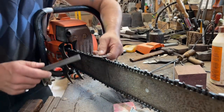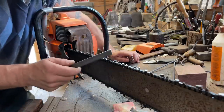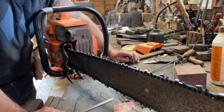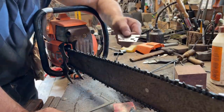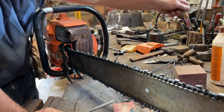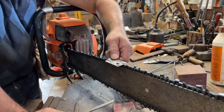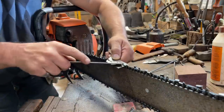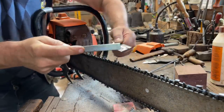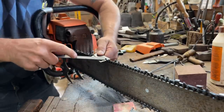And to answer questions, someone asked me, are the rakers the same size on each side? Well, friends, I didn't understand. I don't know who answered the question, but that's what raker gauges do. It didn't matter if you had 15 power saws lined up. This is the gauge. They'll all be set at that. Every tooth will be set at that gauge. I don't care if this tooth here is half the size. You see, this goes like this. This one here, same way, it's the other side.